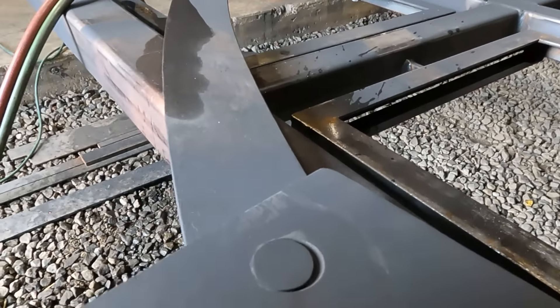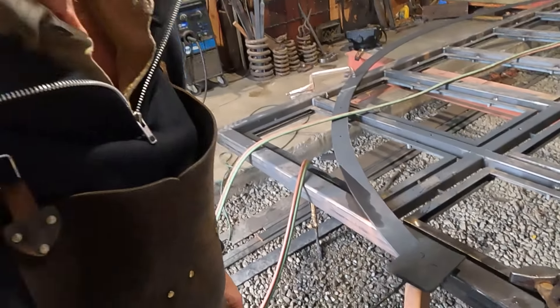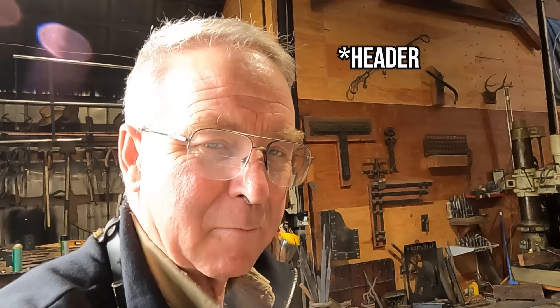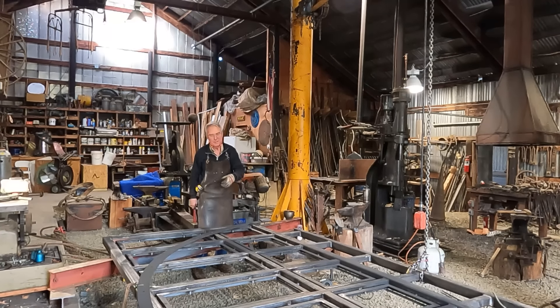So that's two out of eleven. Four of them are these blind rivets that are riveted down into a countersunk hole. This backside is going to be largely accessible for sandblast and paint. The other side is the presentation side. I'll do the same thing on the other end and then start the longer rivets, which have to go through the arch, through two inches of square tube, and leave one and a half rivet diameters projecting to be riveted back to that kind of bulging mushroom shape. Contrary to what usually happens, the second time didn't go as well as the first — I had my little anvil post on concrete and it made it jumpy. But the bottom line is, it's got to work.